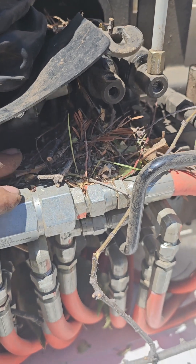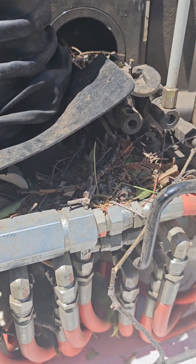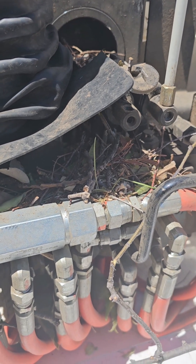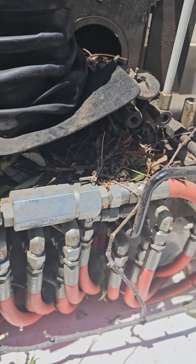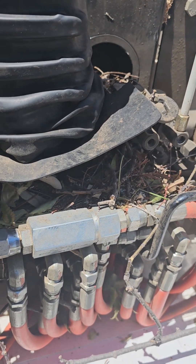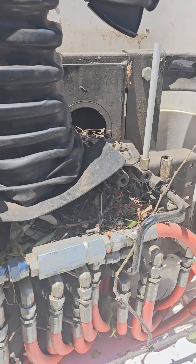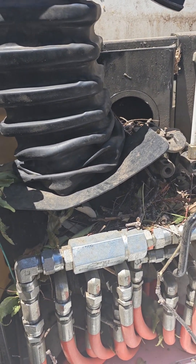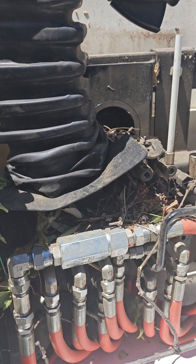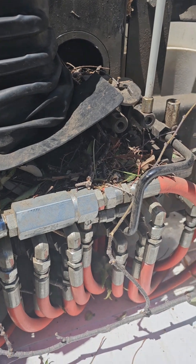While we're here, we're going to clean up this entire hand control. We don't like any kind of debris on our hand control — we want to clean those daily. It must have gotten away from this person, and I'll have a talk with him. By doing that, we just made our lower boom fly 20 percent faster, and we've got happy trimmers, more trees being beautifully cut all day. Anyway, thank you for watching — that's it, see ya.